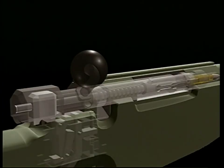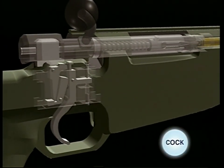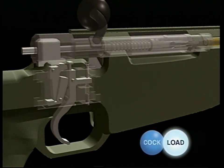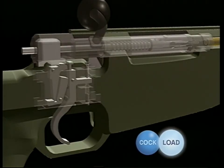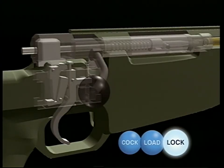To fire, you need a trigger. As the bolt is pushed forward, the face of the cocking piece gets held back by the nose of the sear. The same act of loading compresses the mainspring between the striker collar and the front of the shroud. With the bolt locked and the firing pin held back in this fashion, the weapon is said to be cocked and ready to fire.